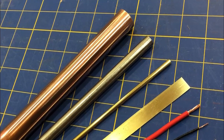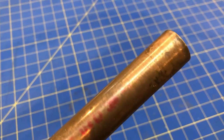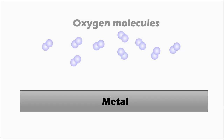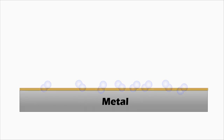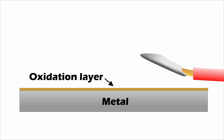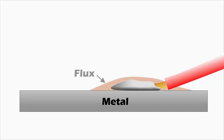So back to the first one. Clean is pretty self-explanatory, but what exactly is oxide-free metal? Just about every metal out there exists with an oxide coating on its surface. The brown color of this pipe is a layer of copper oxide. The oxidation happens because we live in an atmosphere that contains oxygen, and the metal we are trying to solder has a surface that likes to bind oxygen atoms. This layer acts like a barrier to whatever two metals you are trying to join, either by soldering or even welding. So for soldering, the oxide layer must be removed so the solder and metal can come into direct contact, and something must be added so when the metal is heated, no oxidation forms.